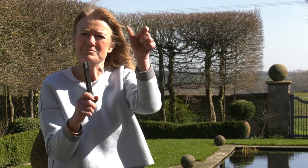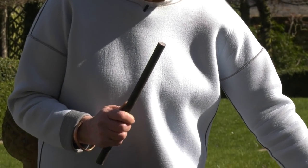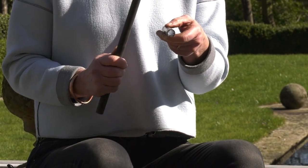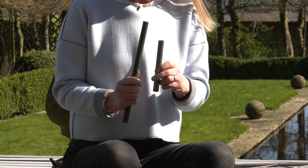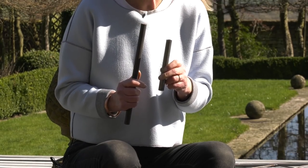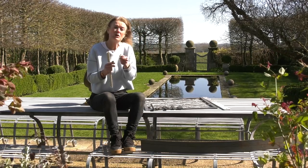Bending the flat bar to show the wide face is a bit more expensive and difficult. The structural difference is also quite marked - a bar bent to show the wide face won't flex so much, whereas bent the other way it can flex a bit, so you need a decent size to prevent too much movement. You can also get round sections and hollow tubing, which is much lighter than the solid bar, less expensive, and you can shape it into any shape. This is what we used for the vaulting at the school - all made from hollow tubes.